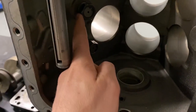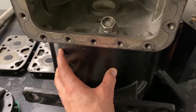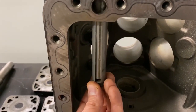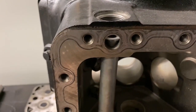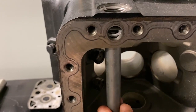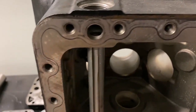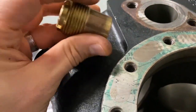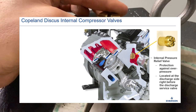Right up here is your vent. As the compressor starts to run, this will send pressure into the body, so the body has 2 PSI higher than the crank. This is your oil pickup feed — you see how this is pointing down? This needs to be pointed down. If you turn it the other way, it doesn't fit in properly, but you could jam it in there anyway and it will close. There's also the internal pressure relief right here — it separates suction and discharge, rated at 462 PSI. That goes right inside on our 4 and 6D compressors.